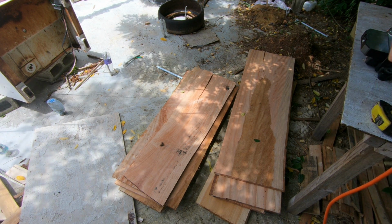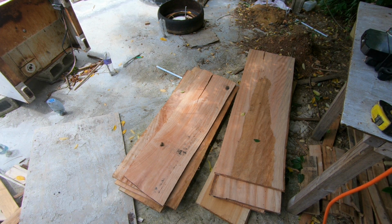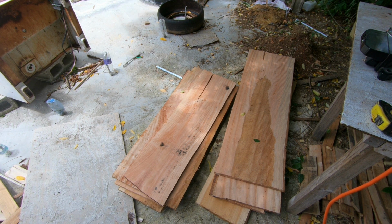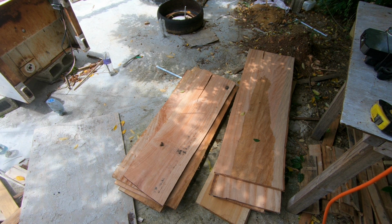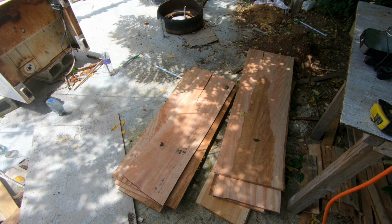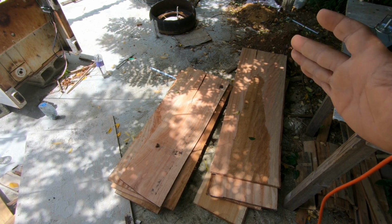Super important that you have the wood jointed, so then when you start stacking, the woods will sit perfect with each other. There would not be any gap. Again, very crucial, because if the space is not sealed tight, when it gets down to the more stressful period for the bees, robbing, those little gaps will become crucial. You've seen me have videos where I made boxes before where robbing was taking place and I had to use stuff to stop the gap, guys. Very important that you have the edges jointed. You learn from my mistakes.